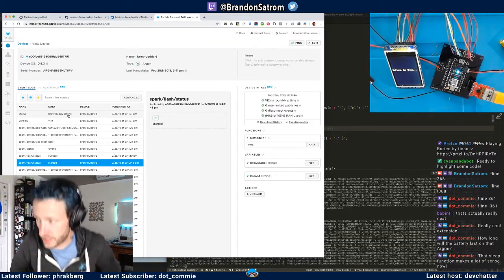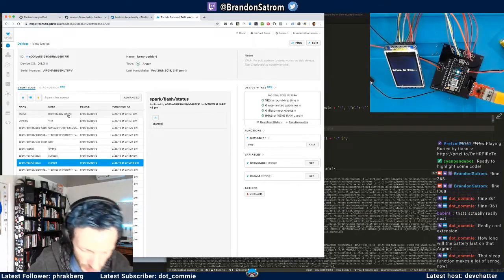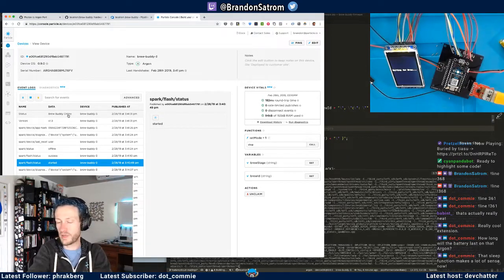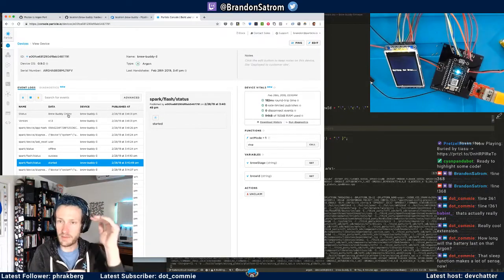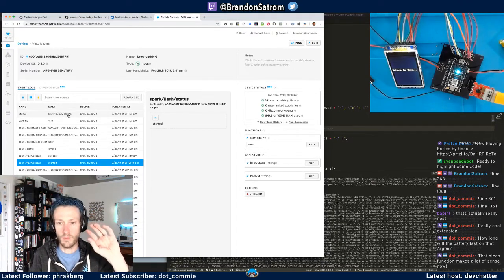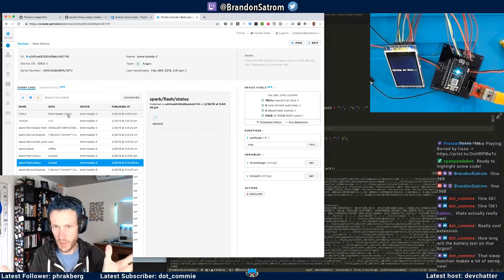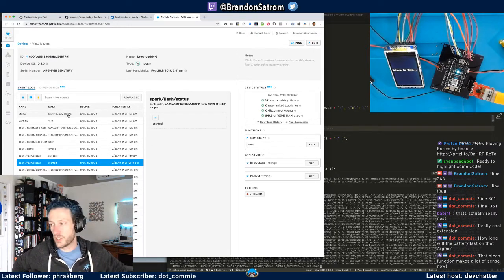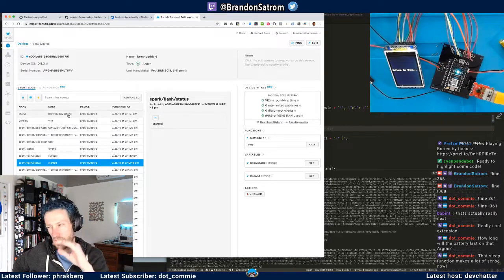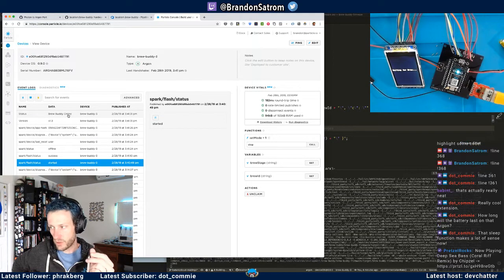The sleep function makes a lot of sense now. Exactly, .commie. I probably need to mention that more, but when you're done with the brewing process, it's a day or two before fermentation starts, and I want the device to be ready to detect when fermentation starts. But to stay connected, right? But to not use battery power. So that'll basically just do nothing for 2 days other than run at just microamps probably to detect the voltage on the NOx sensor.